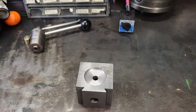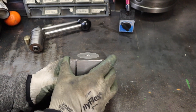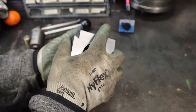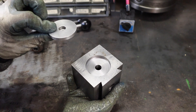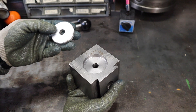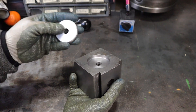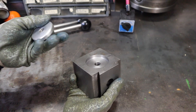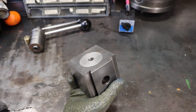I'm actually really surprised how well that went. The final fit — it's quite tight but that's a really flush fit and we've got pretty much no movement in that. So much so it gets stuck in there, but I'm quite happy about how this has turned out. We've only really got a few things left to do now. I'm going to take this boss over to the milling machine and drill and counter bore some holes so this can be counter-sunk onto my compound slide. Once this is drilled, I know exactly where I'm going to be drilling holes in the compound and we can drill and tap them to final size. I'm really excited to see how this has turned out because so far this has been a great little upgrade to the quick change tool post.